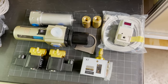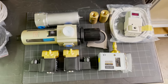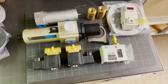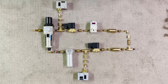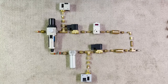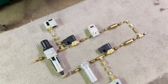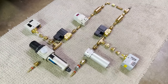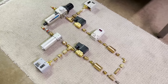The parts have come in so I can finally start building the gas assist system. I should have done a little more research before buying all these components because finding all of the correct fittings for all of these turned out to be quite complex. I was dealing with different port sizes and different thread types from both Europe and the US, and ended up having to buy way more fittings than should have been needed for this project. I was also taking into consideration the price of the fittings. Sometimes I could use a couple for way cheaper than buying the exact part I needed.